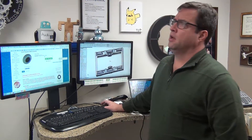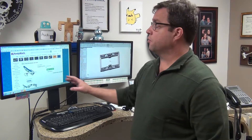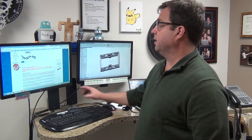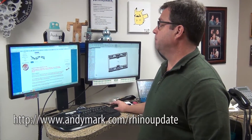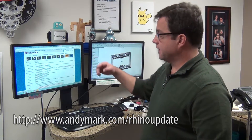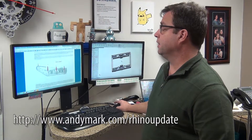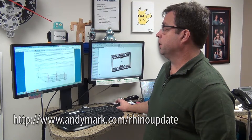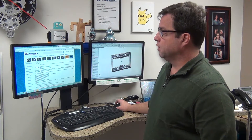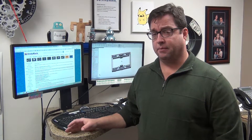On Monday we figured out that some of our pulleys were fracturing for the Rhino Tractoride. These are polycarbonate pulleys — they're getting a lot of stress and strain on the system. On the Rhino Tractoride module, there is a page that we've been updating that chronicles the issues we're having and the testing that we're doing. You click on that and you can see what's happening with these pulleys and how we're improving them. If you have trouble with your pulleys, email us at sales@andymark.com.